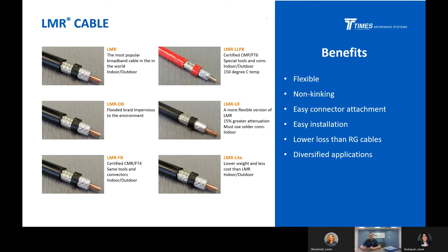Here we're looking at six of our most popular LMR cable constructions. The LMR construction is a low-loss, rugged, non-kinking construction. We have our standard cable, which is closed-cell foam — a great indoor-outdoor cable, very rugged, with very good UV resistance. Just below it, you see the DB, where we flood the outer braid. This is something you can basically run through a pond — you don't have any concern about any breach of the jacket because you have a blocking compound right underneath the jacket.